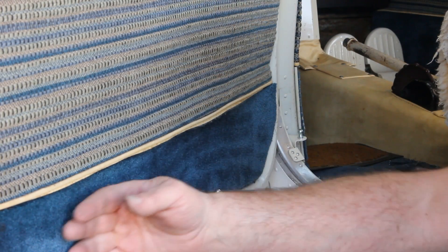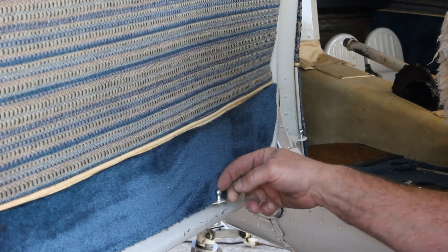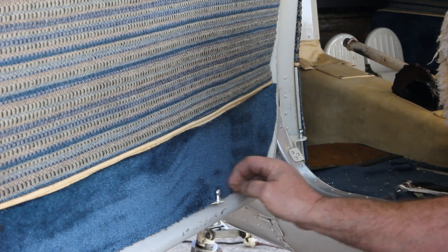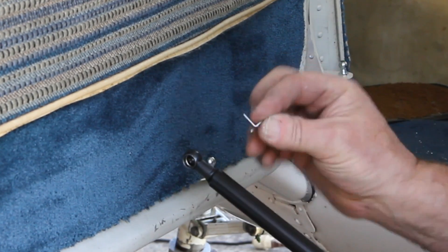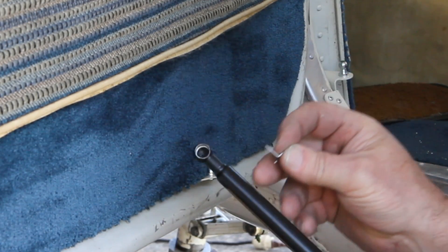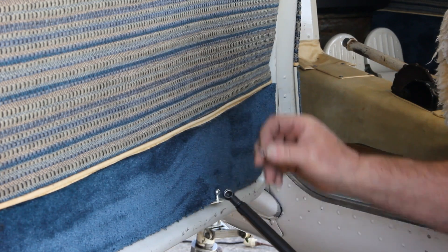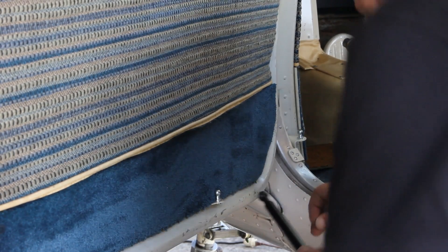There we have the door bracket final installation. We've trimmed out that spring clip and reattached the door panel. You can see why we didn't need that spring clip — the ball stud is going to keep that panel from going anywhere. Now we're going to put the gas spring on. The gas spring has little safety clips that engage in the end fitting as a secondary locking device. We'll put it on one side first, put the safety clip in, then do the other side.